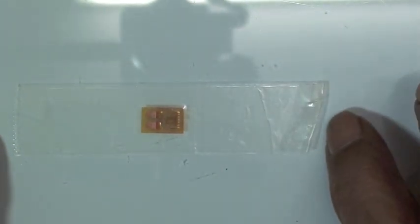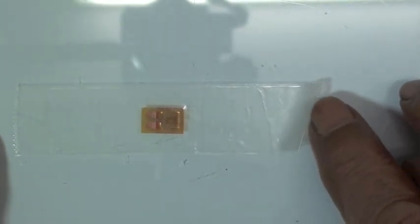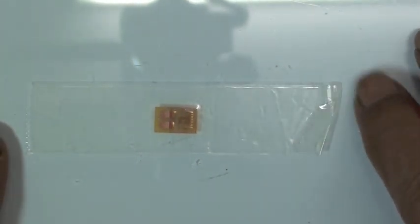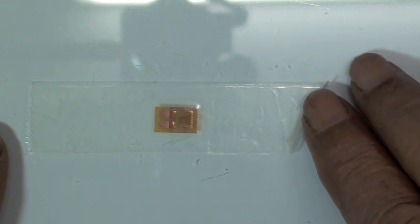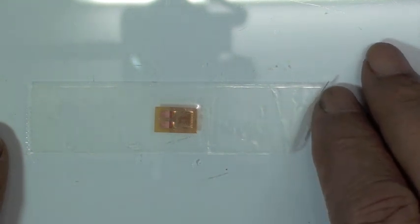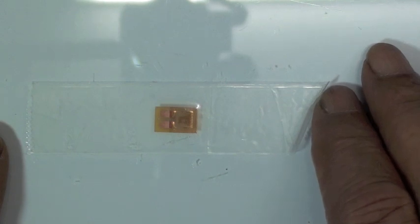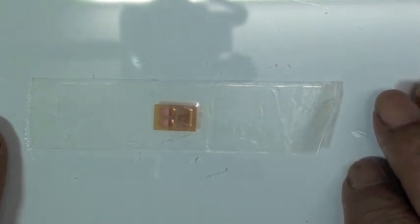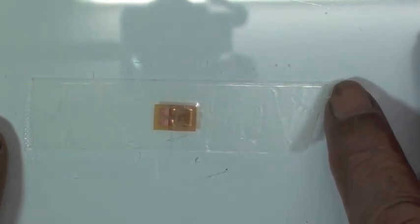This is a very common way that people who are installing strain gauges can get a large offset. They'll stretch the tape very tight, stick it to the strain gauge, and then lift it up later, and that tape relaxes and it takes the strain gauge with it. You get a very large compressive offset. So the way VJ did this here is the recommended way to do it, so that you'll have a strain gauge that is close to its resistance tolerance.